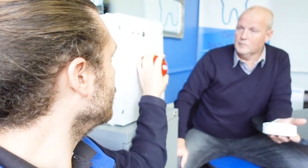There's a delay, and it can be set by the client. We're sort of saying 2 minutes, 3 minutes, 4 minutes, but if you want me to prove it, Dan, I can prove it to you. We'll ring it, and we'll hold it rung for a minute or so. So that goes off. So it doesn't go off immediately. No. Although we get the text message and everything from it. Absolutely. But we don't get a full evacuation of the floor from the main detection system for the communal area, for example. But there's a delay. So it's going to be noisy for a little while.